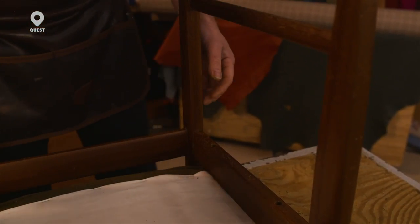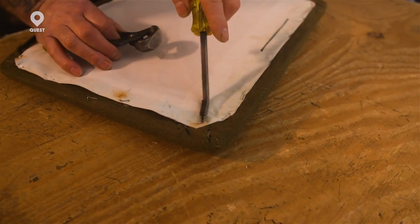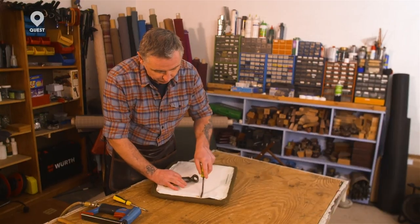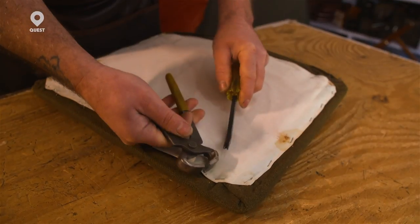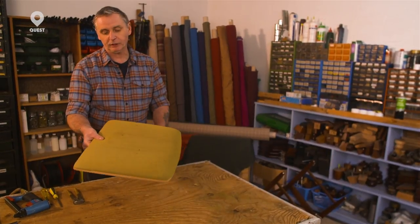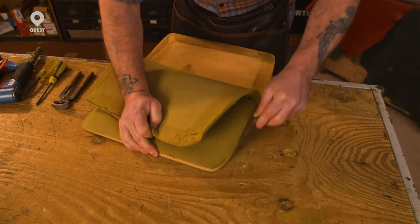Work with the chair upside down. That's the screws undone — I'll lift the frame off and just put that to one side. So now the seat's off. To use one of these staple lifters, there's a pair of prongs on the end — get them down into the staples and lift it up. Now I've found out that the foam is useless; it might look okay but there's just nothing to it. These foams are glued onto the board so what you need to get this off now is a scraper.